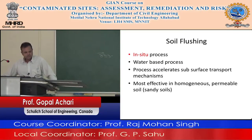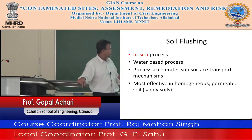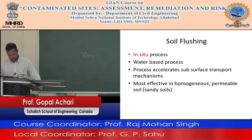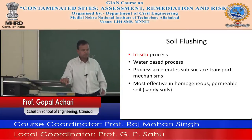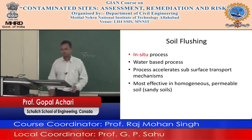What do we do with the wash water? Wash water is the water that comes out. You have to do some treatment for it, okay? If your wastewater contains inorganics, you can do precipitation, you can do ion exchange, you can also filter the water out. If you have organics, you can do air stripping, which is basically pump air from the bottom, and the organics, if it is dissolved phase, will just move on with the air. Carbon adsorption, you can do biotreatment. We talked about biotreatment in the morning.